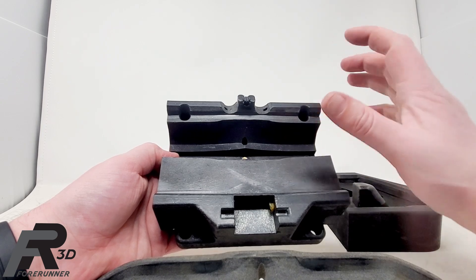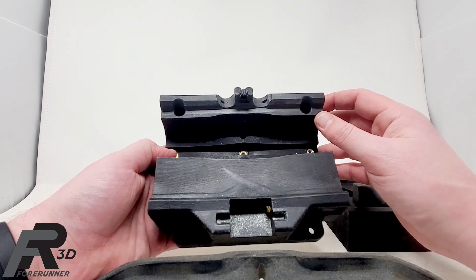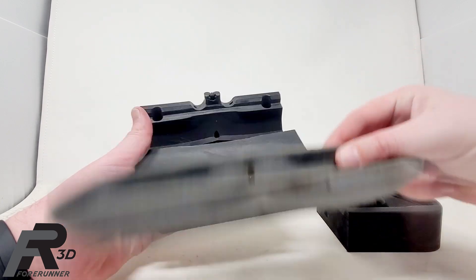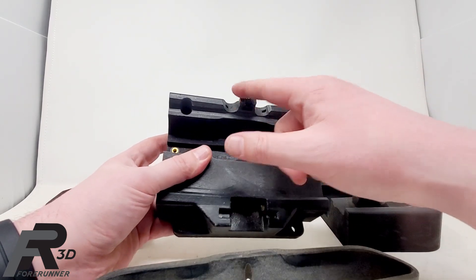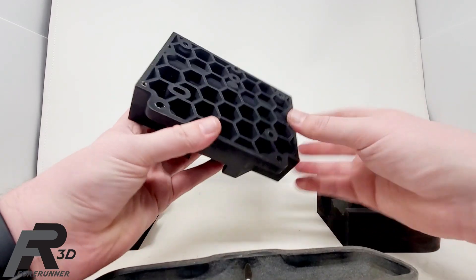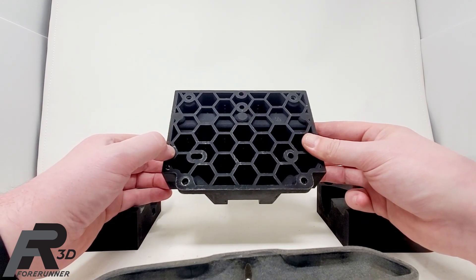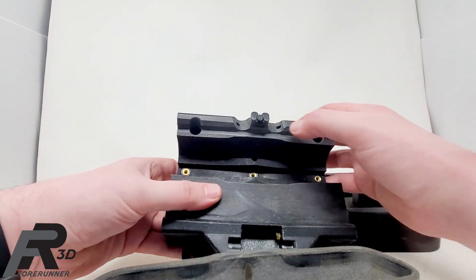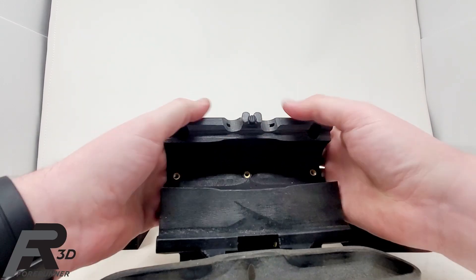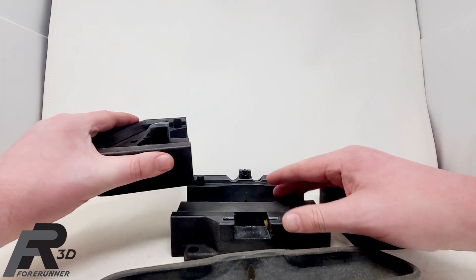They actually had to modify the nests on a Bridgeport about a year or two ago — there was a slight engineering change and they had to open this nest up. So you can see this nylon material, and even the TPU material, is machinable. If you need to make edits you can chuck it up in a Bridgeport and cut it up. This even has the honeycomb on the back side that we use to take mass out of these parts. They broke through into the honeycomb a little bit right there, but it didn't affect the structural integrity at all.